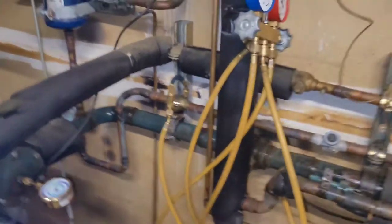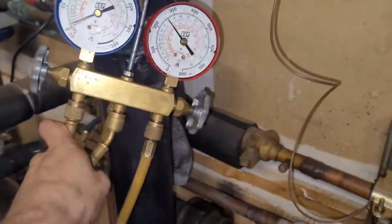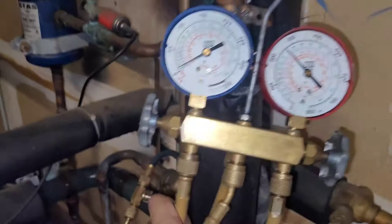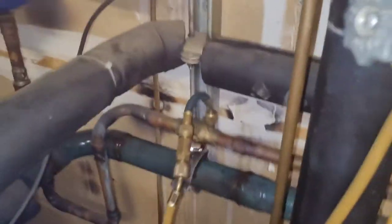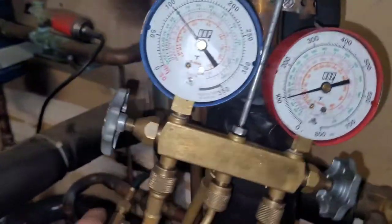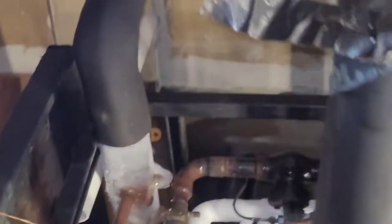This is going to be the low pressure circuit, probably for the frozen stuff, because we've got 12 PSI, 10 PSI something like that on the suction, and 250 running liquid. I love these gauge ports because I can close them when I'm connected to liquid, and then I can just put the refrigerant back into the system without getting liquid everywhere. It doesn't make a big mess and doesn't burn me with frozen freon.